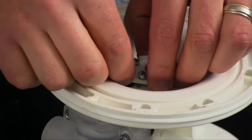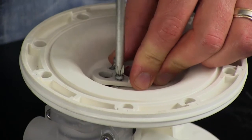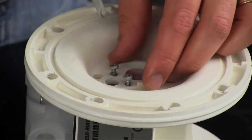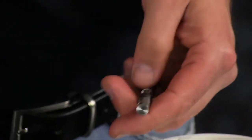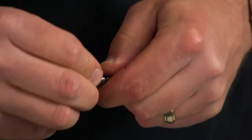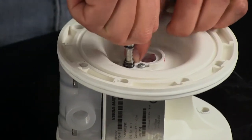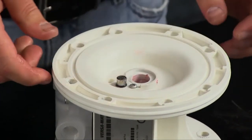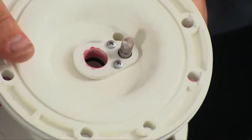We can now install our main shaft retainer plate. Repeat this process for the second side. Remove the pilot spool O-rings and discard. Inspect the spool to ensure there is no damage, scarring, or scratching. Install the pilot spool O-rings into the designated pilot spool O-ring grooves, working your way down and leaving off one bumper O-ring. Apply grease to the pilot spool O-rings. Now install the pilot spool — note that the bumper O-ring that has not been installed yet shall be inserted first into the pilot sleeve. You may need to turn, twist, and gently press in the pilot spool to ensure we do not damage any of the pilot spool O-rings. Once the spool is fully installed, install the bumper O-ring on the opposite side.